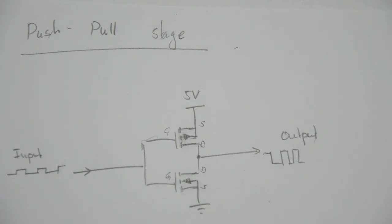And in fact, I could go out and look for transistors that match this requirement of a threshold voltage of 2 volts. However, I'm not going to do that because first of all, I can't be bothered. But second, if I mess this up, then both transistors are going to be on at the same time. And I would have a short between my supply rail and ground. And I don't want to have that. And second, and of course more importantly, if I built this out of discrete components, we never talked about any voltage that is somewhere in between 0 and 3.3 volts. And it might happen that both transistors are going to be on at the same time intermittently, hence again shorting my supply rail to ground. So I'm going to do something else instead.